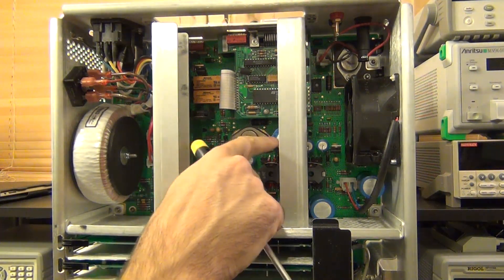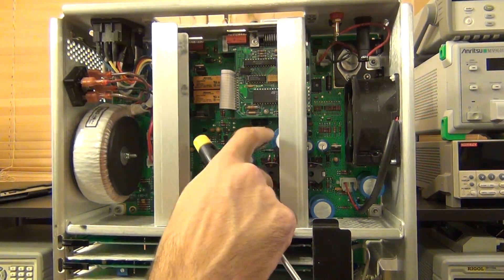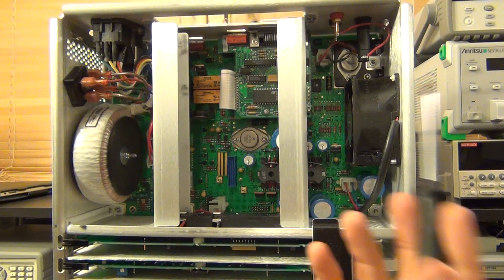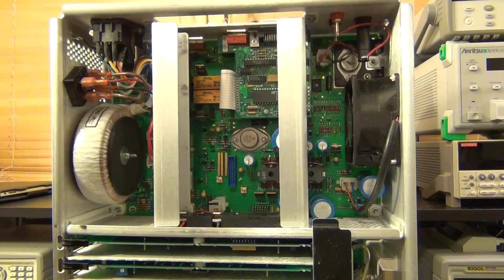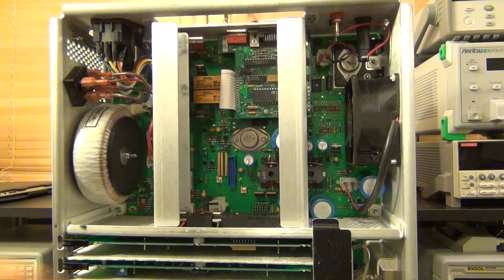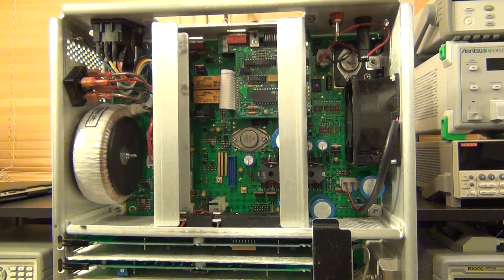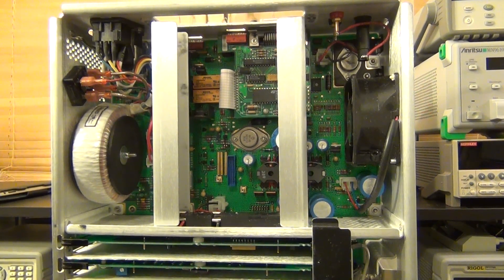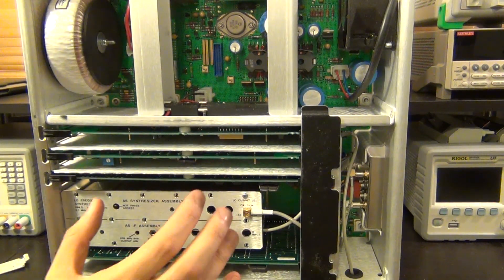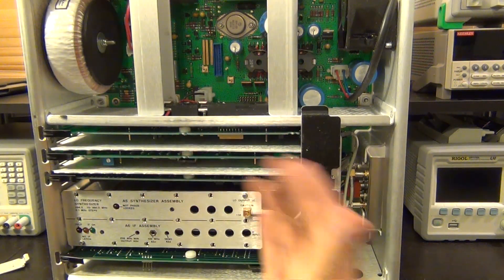Okay, I've connected everything up and we're ready to do some measurements. I've plugged it in and connected it to GPIB from the top, because it is possible to send this unit a GPIB command which puts it into a fixed frequency mode so the LO is not sweeping back and forth. That will be helpful for debugging to see which part is not working. But for now it's in regular mode. We're going to use the MDO4104B-6 — this is my default debugging tool nowadays because of all the great functionality it gives me. We're going to measure time domain signals as well as the spectrum to look at the LO coming out.